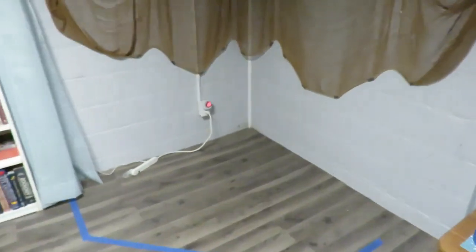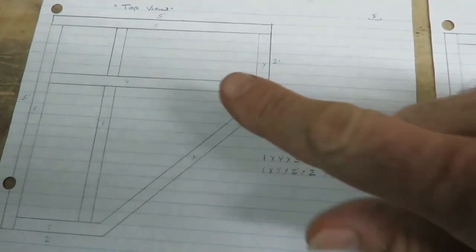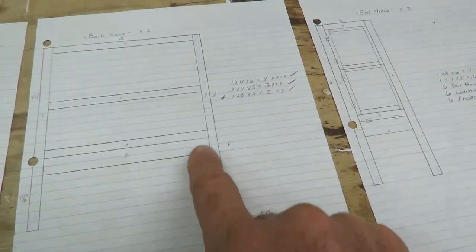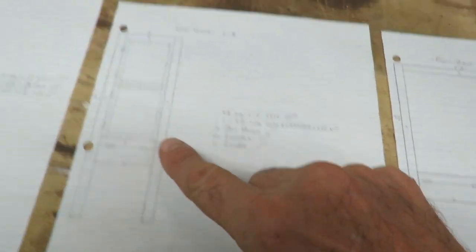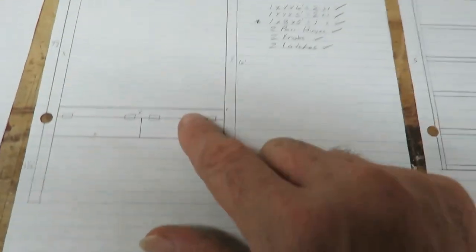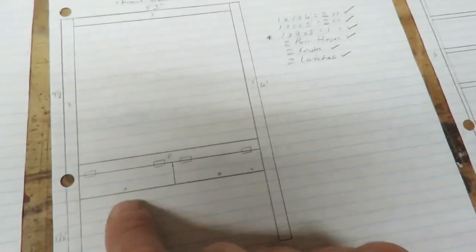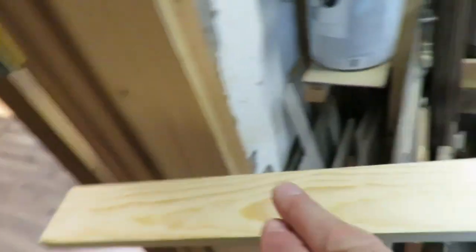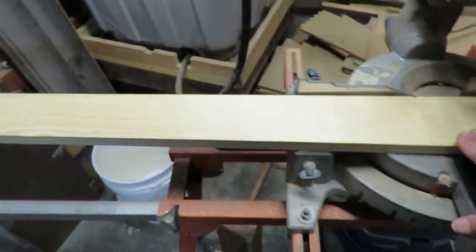I'm going to have the bottom of it be just above that outlet. I drew up some plans. This is going to be the top, so I have room to set lights on here and it'll be sitting on wood, not just wire. Then there are two back pieces, six foot tall, joined with pocket holes. These are the ends — the two-foot-out pieces — and these are the ones that actually have the doors with the hinges. There'll be a door in each end and two doors in the front for cleaning. The bottom panel sits on the bottom, and on top of that is the hardboard.